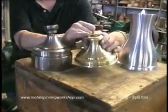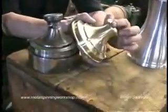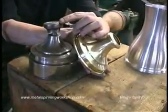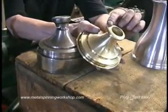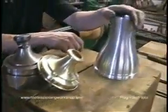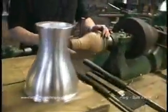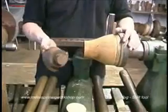Now, this also on the end here, if you can see, has a rounded edge. What's happened is it's been trimmed on the nose here, then it's been put back onto the mandrel, and this has been spun over with air spinning, or spinning on air. But for the demonstration, let's concentrate on this lamp base, because if we look at the tooling, it's a much larger size and it's much easier to understand.